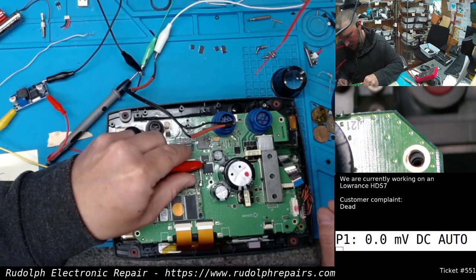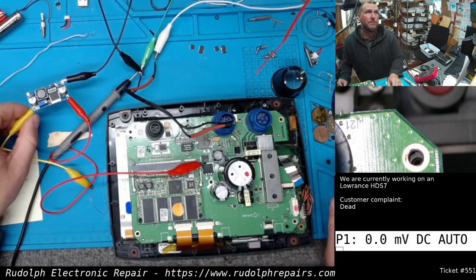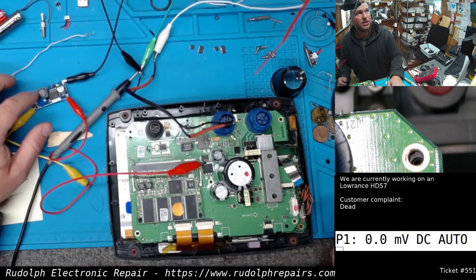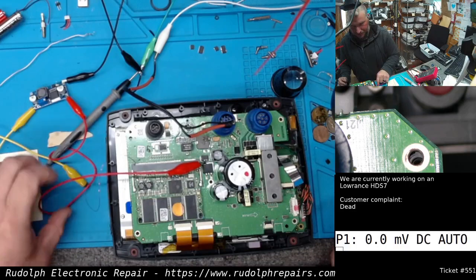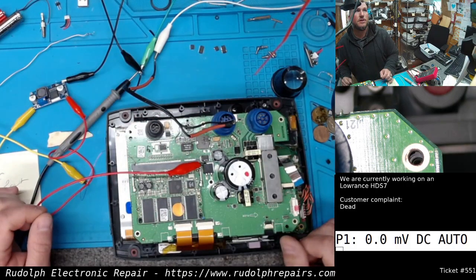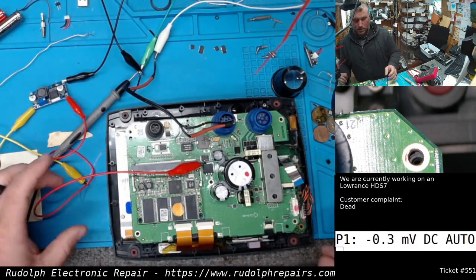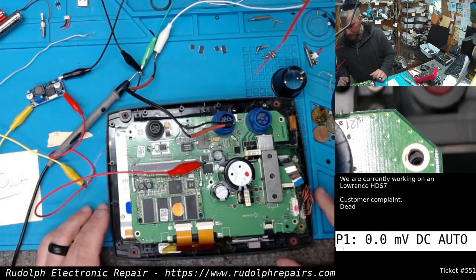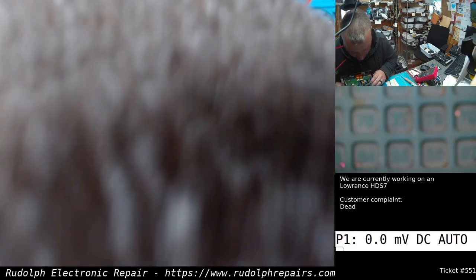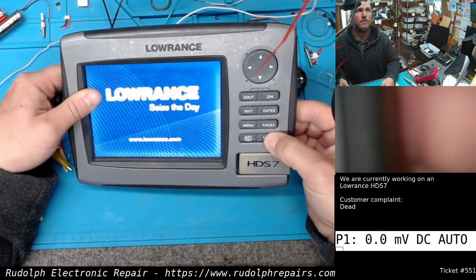We're going to clip the VIN — the 12-volt input — to the drain of this MOSFET, because we don't want our 5-volt supply on until the power button is pressed. We don't have to worry about the ground of our output because it's all on the same ground potential. Then from the output of our buck converter, we took a piece of enamel wire and went to pin one of the CPU card connector — the left pin from my perspective. We're going to the output of our buck converter to that pin. This thing might either blow up, start smoking, catch fire, burn the place down — or maybe, if we know what we're doing, it'll work.